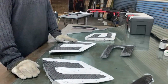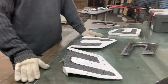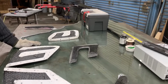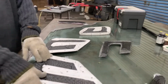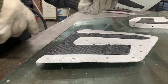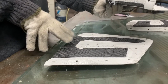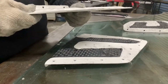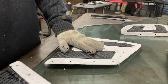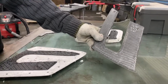Trimming is done. You can see he's got them back into the molds. He's got a couple more proprietary things he's going to do to them, and then it's a clamshell: this piece connects with that piece. Yeah, they mate together. These get bonded together. Two inserts get machined and then stuck in here when they get bonded together, and then after 24 hours they get unbolted and then popped out of the mold. Okay, and then again, this is our theoretical, close to finished product.